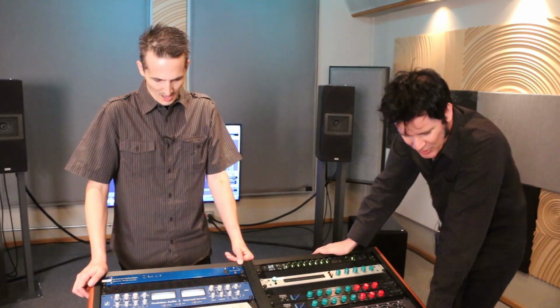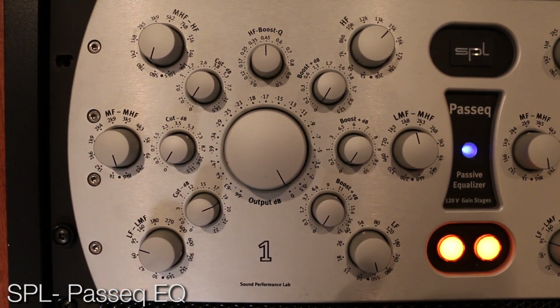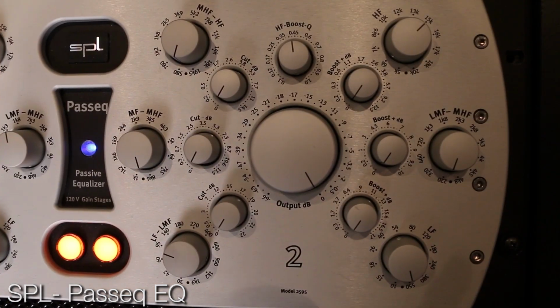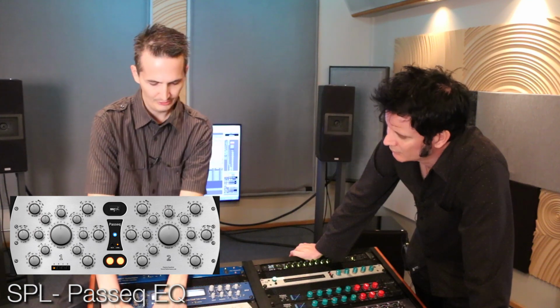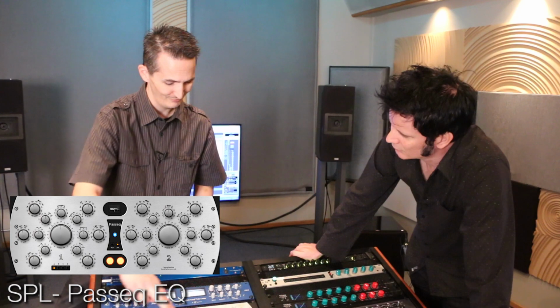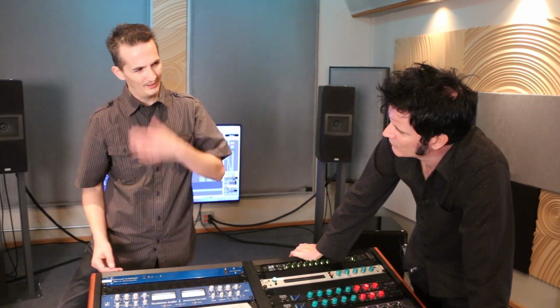SPL. Talking of SPL. Yeah, this is a pretty special EQ. Similar to a Pultec in that I have low frequency cut, low frequency boost. So the way this is laid out is odd. There's an output gain. It's only attenuation. I don't have any actual gain. It's an attenuator. I shouldn't call it gain. And then this side is cut and this side is boost. And then we've got a Q for this. So low shelf cut, low shelf boost. I can do them at the same time. Yep. Similar to a Pultec, although the cut isn't a bell. They're both shelves. Interesting. So what does it do?